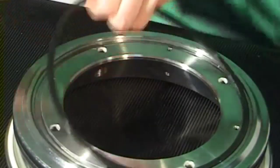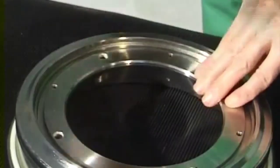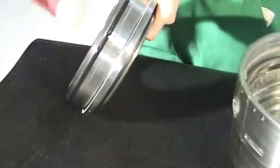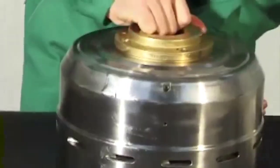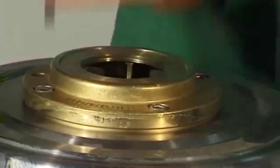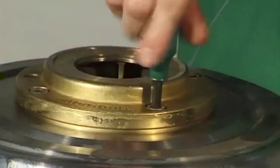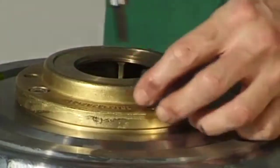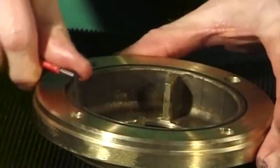Take the gasket out of the annular piston. Drive apart the annular piston and the closing chamber bottom using the mallet. Turn the bowl through 180 degrees and unscrew the Allen screws from the water chamber bottom. Force off the water chamber bottom using the screwdriver and remove it together with the gasket. Take out the gasket.